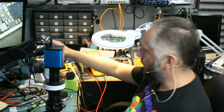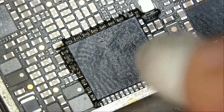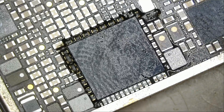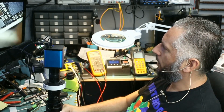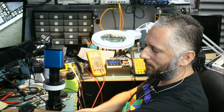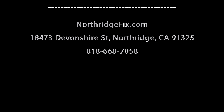Replacing the chip is not an easy job because it's in a very tight area with a lot of surrounding components — you don't even have room to lift the chip, and there's underfill. It's going to take a lot of work and precision. I'll have to communicate with the customer; it's going to cost a lot of money. We don't even have that chip in stock — we'd have to order one. But at least you got to see what goes on behind the scenes when figuring out why an iPhone is not powering on. Hope you enjoyed it — like, subscribe, leave a comment, and we'll see you next time.